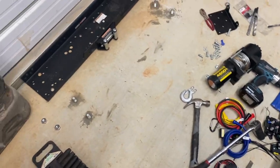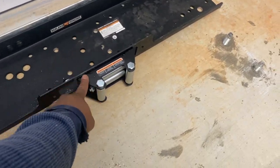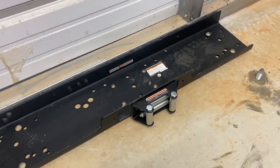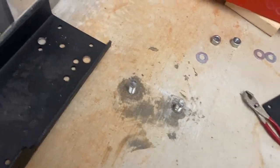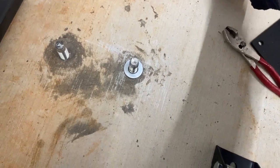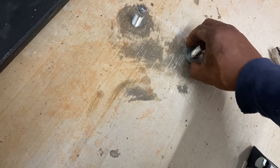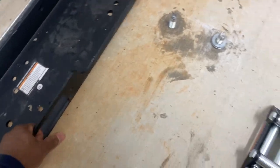Anchoring the board with that small hammer, man. So I'm about to time lapse y'all again, clean this up, put my air compressor on, switch to the welder, turn the welder on, turn the gas on, tack that in place. And then I'm guessing I'm gonna need like 12 of these same size washers, three each side. That should give me the thickness of the bolt, just from my guessing. From the head, that'll stick out, maybe even four. We'll go four.